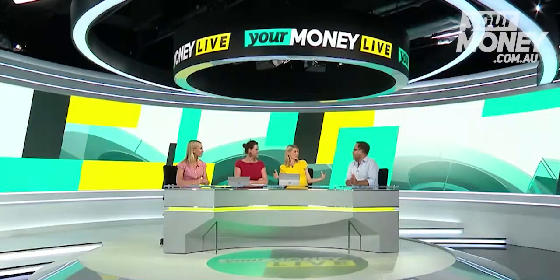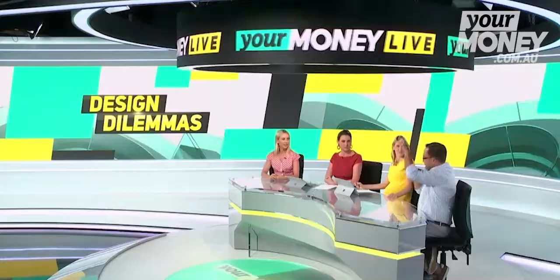Are big, heavy, wide doors becoming more in vogue? Like, are they really quite popular right now? I feel like there's a lot of them popping up. They're in vogue, and you can have a different style. So one large door can be hung from the side, so a hung door. But a lot of wide doors, those 1200 wides, especially when I do 2400 high, so 2.4, so they're big, are pivot doors. So instead of hinging from the side, they pivot from the hinges set in to the door, so they end up opening to about 1100 wide, and that's why it's called a pivot door, and that helps cope with the weight of a very heavy door.